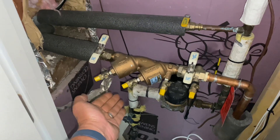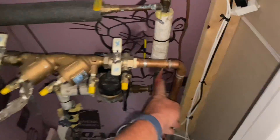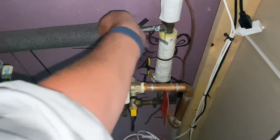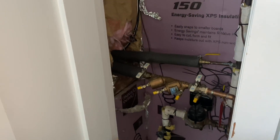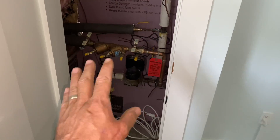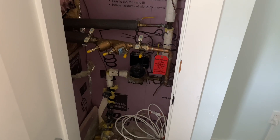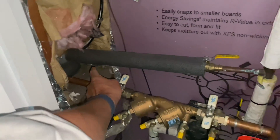Back to the video. I was wrong — it's an Apollo. This is an Apollo three-quarter-inch double check valve right off the water main. We'll turn off the water here. We'll drain outside via the hose faucet — make sure we open that up. It froze — look, there's the crack right there. That is insane — the pressure inside this valve split the cast brass. It's crazy.